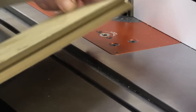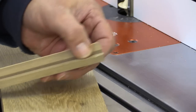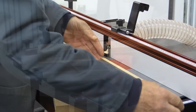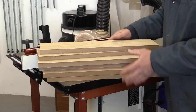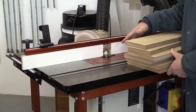I've got this set up nicely now and that's making a perfect cut. If in your practice cuts you get a little bit of snipe — I've got it here — that's caused when the fence is too far back. I've cut all my drawer fronts to size and I'm now going to run them through the router table to put the channel in which will take the hardwood edging.